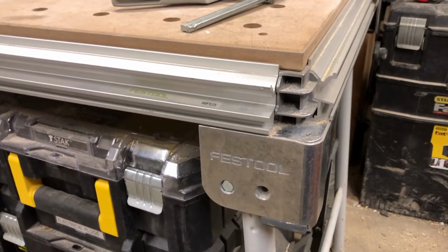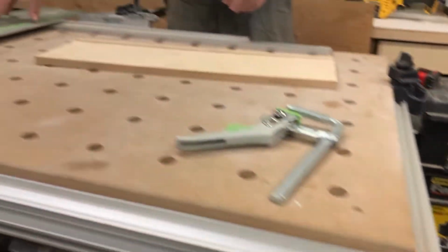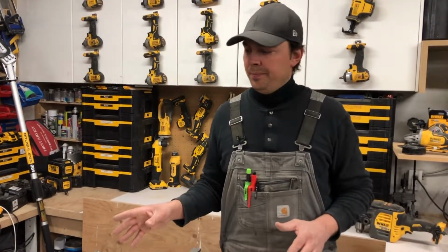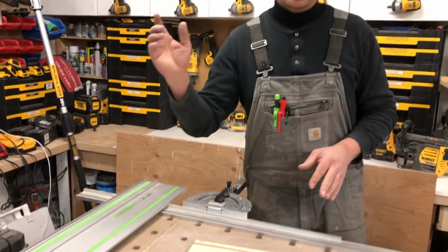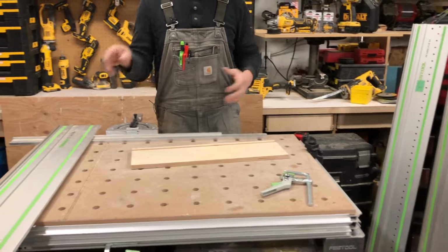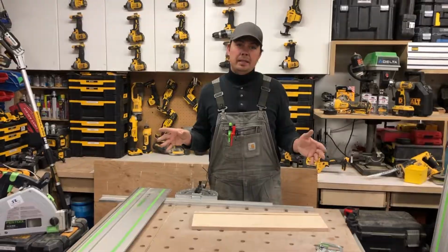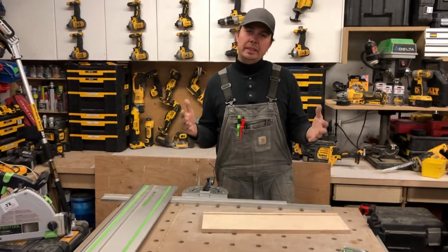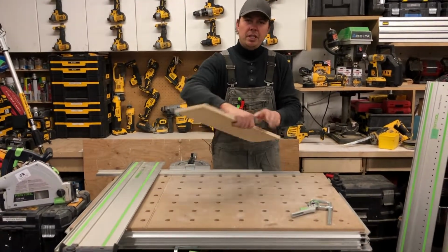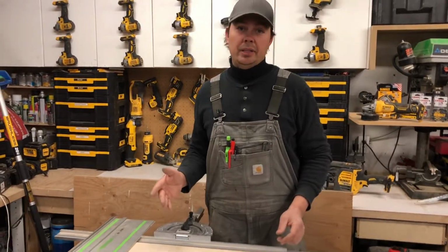The reason I really like having that, I put them end to end, is because I'll have 2 cutting stations essentially. So if I'm working 2 ends of a product, I can slap this down, cut that end off, slap the other end down, cut that end off, and I don't have to turn my product around constantly. And it really helps if you're in a tight space. And if you're working in a kitchen, it just makes it really easy not having to move the material around like an 8-foot sheet. It's just super easy just to lay it down and do your cuts.